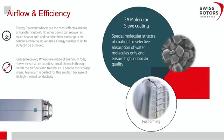The matrix is built of aluminium foil. We do not use very thin foil like others — we use 0.07 mm thick aluminium foil. Depending on the type of recovery desired, there are a few types of wheels. With this combination of aluminium foil and coating, we can reach up to 90 percent energy saving using this wheel.